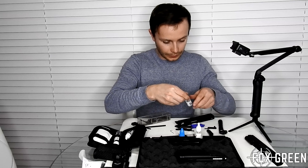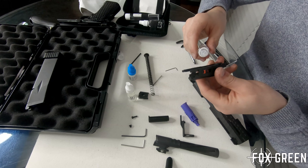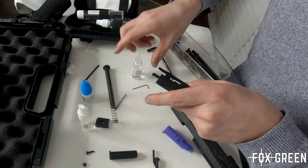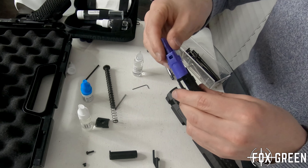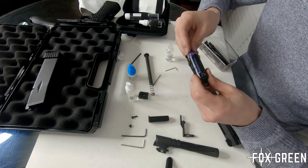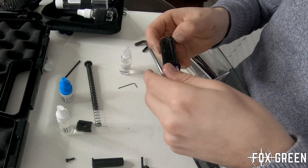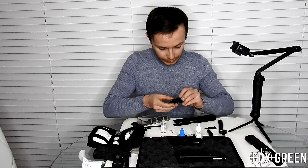With that done, I'm going to apply the thick silicone oil simply around the little rubber seal inside here. This will just give it a little bit of lubrication - just a small amount, doesn't need to be massive. Give it a rub around, put maybe another bit on this side. Then simply insert this piece back in. Move it back and forward so you can feel that becoming loose. Then drop this spring right back in place - it's quite happy to sit in that position.